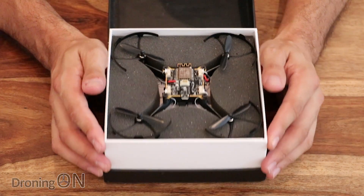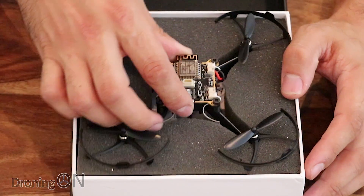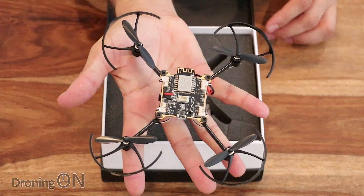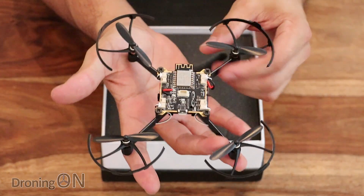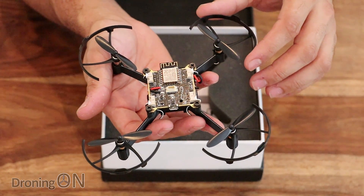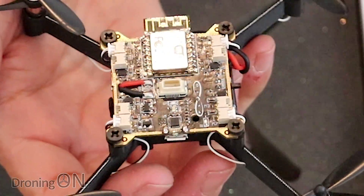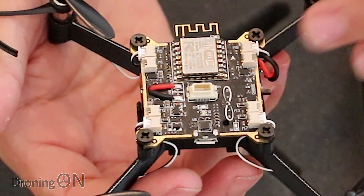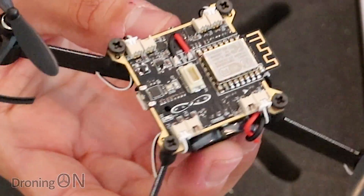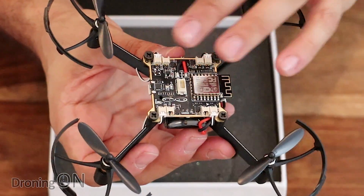Hopefully this review will show you what you get out of this kit. It's scheduled to deliver in January 2019 and is available in two different colours: black or red. It isn't just a camera platform. You get a baseline kit — a 3D printed frame with four little brushed motors and some prop guards built in. Inside is their core custom flight controller, which contains a number of different elements including the sensing board with barometers, gyros, accelerometers, and magnetometers, as well as inputs for motors which are also reversible.